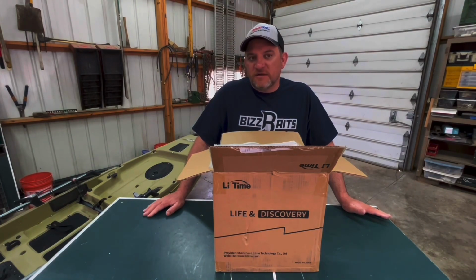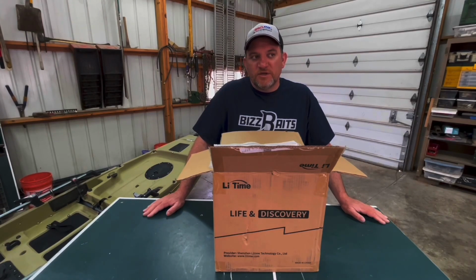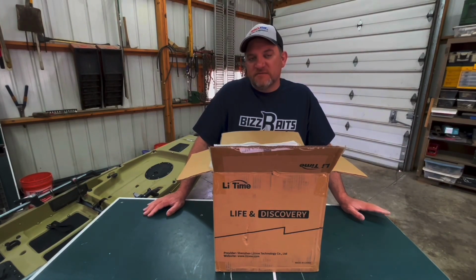There's lots of different thoughts. There's different sizes of batteries. There's different amp hours of batteries. And really it's to be particular to what you're going to do. I'd like to go out all day, long distances. I got a little bit heavier one, so I want it to at least last me 12 hours is what I'm shooting for. Not necessarily at full speed, but at about 4 miles per hour, which is what the trolling motor should be able to do on my kayak.